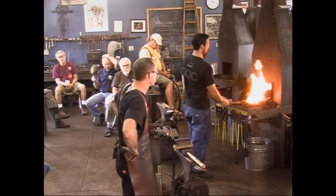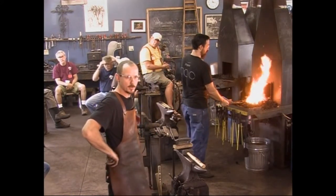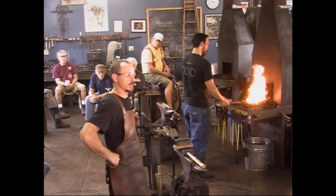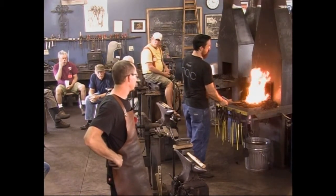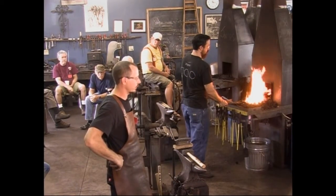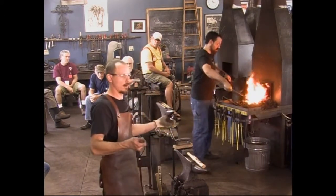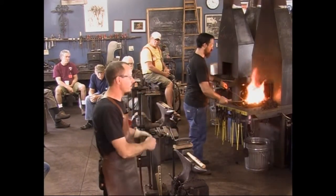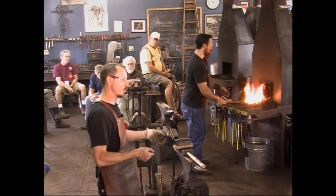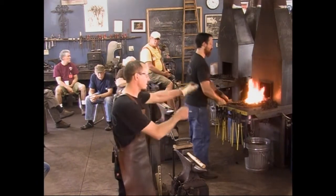Back to heat treating this stuff. Like I said, I'm oil quenching this stuff now to be on the safe side. This last one I did, I was actually really pleased with the results. What I do to test the hardness after I quench, get it hot, do everything right, quench it, comes out, is it hard? Did it work? I clamp them in a vise and I keep a half-worn smooth mill file nearby, and I test it with that.